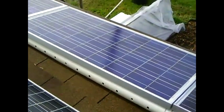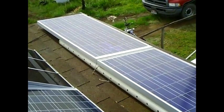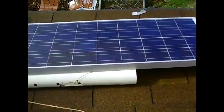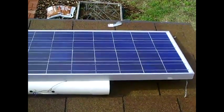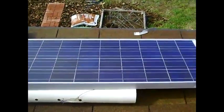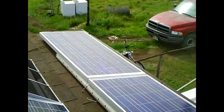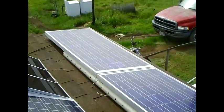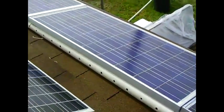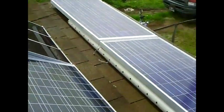My solar panels lay flat against the roof and the power boxes underneath them are protected from the weather. Because of how the drain pipe is situated, any moisture will just run right underneath those panels and off the roof. You want to make sure your panels are mounted very securely — if a big wind comes along and picks up a panel that's not secure, it's going to turn into an expensive kite. Most panels have holes in the edges designed to be screwed into a mounting system.